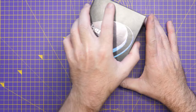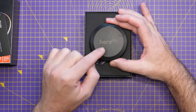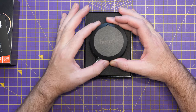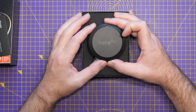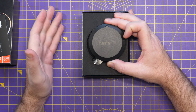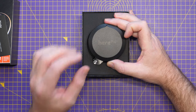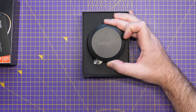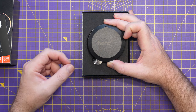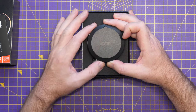The Here Pro is certainly no ordinary GPS module. If we lift the lid, the first thing you'll notice is its sheer size — it is much larger than a standard GPS module, because it has a really high-end antenna on board. This is a professional GNSS module designed to be used with ArduPilot, PX4, as well as any custom software applications. It has not only the F9P chipset from U-Blox, but also a built-in STM32H7 SoC, fully compatible with the AP_Periph firmware from the ArduPilot dev team, and it has ProfiLED programmable LEDs built in.